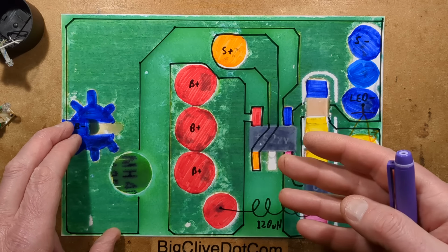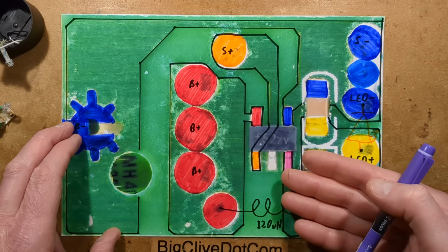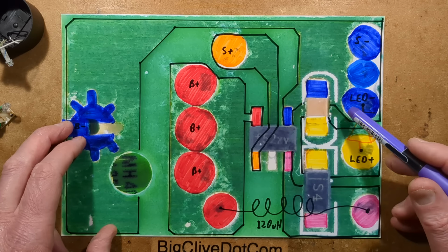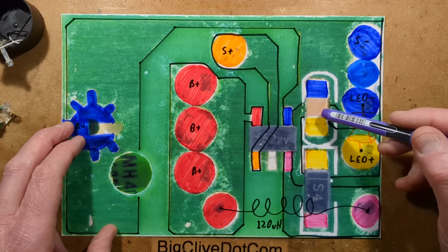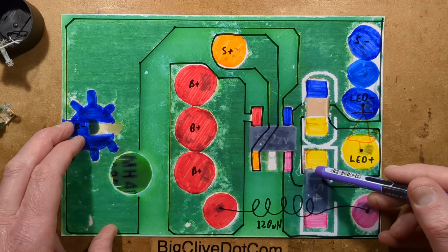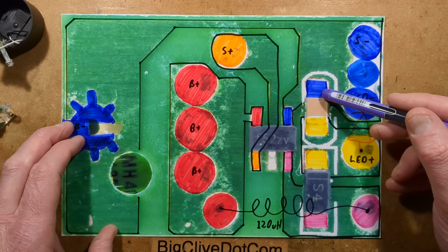It's the classic YX8018 chip, but in a different disguise, maybe a different manufacturer. And because this is a colour changing LED, we've got the extra components. We've actually got a Schottky diode here. You can use a 1N4148 and place that, and then a little capacitor.